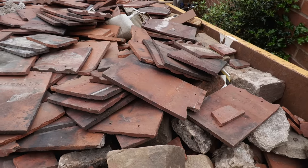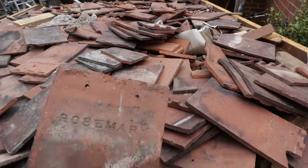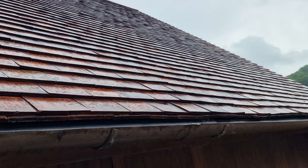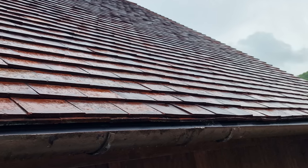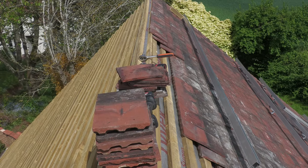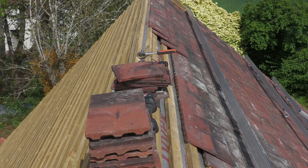So yes, I did end up having to pressure wash every single tile before putting it on the roof, which further slowed down the project. You've only got to look at my skip to see how many tiles from the pallets were broken, the nibs were smashed off, or the wrong tiles had been put in the pallet. With old reclaimed tiles the shape isn't always great, so there are a few inconsistencies on the roof. They do look great, but who knows how long they'll last. Bottom line: if you're doing this job, particularly single-handedly, new tiles are the way forward.